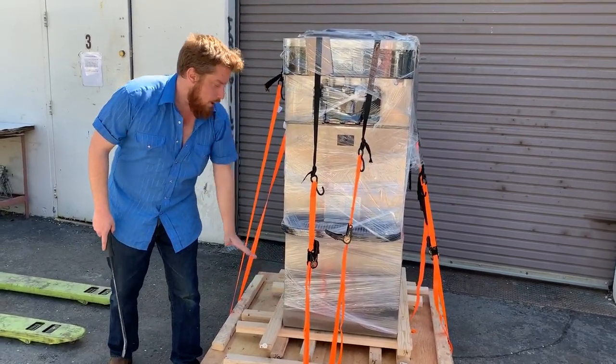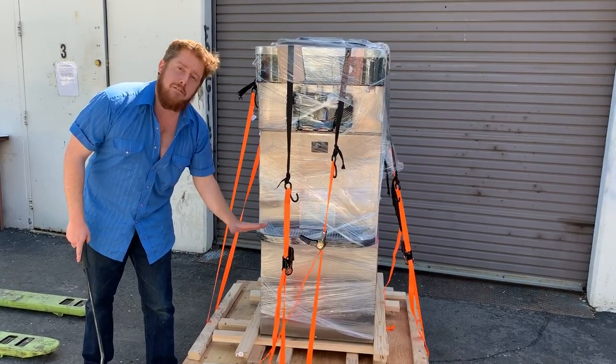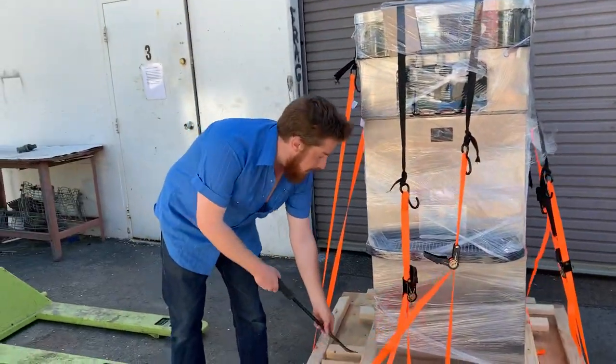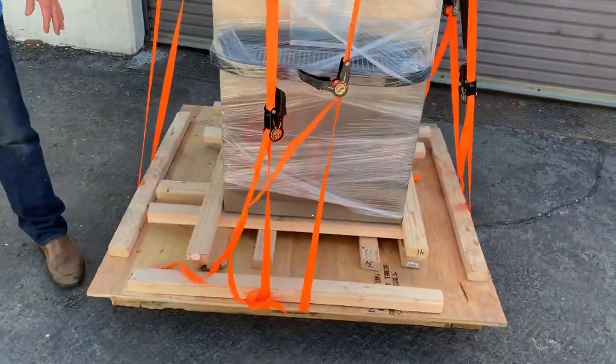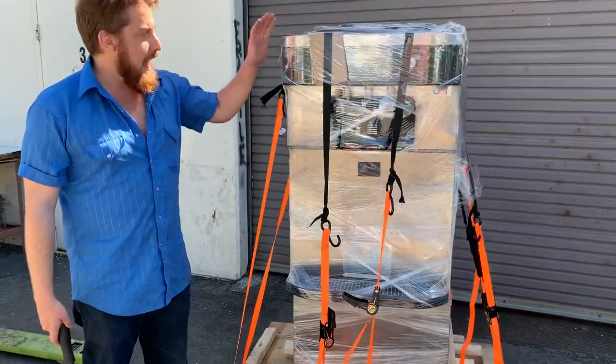Use that wood to help build a ramp, or preferably if you have a forklift, that's great — you can take it off that way. You need to be very gentle. You'll need a pry bar or a crowbar to pop up all of these struts so the machine doesn't move. You're going to need a crowbar, a hammer, and a pry bar, plus two people.